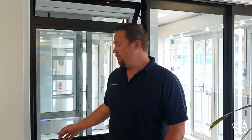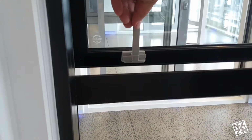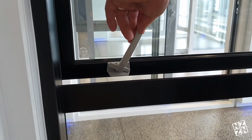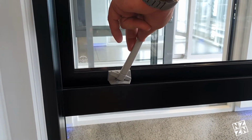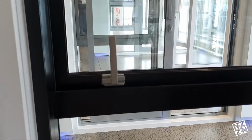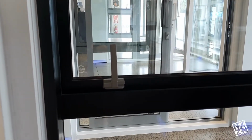So often we have customers report that we have broken wedges in here. The primary cause for that is when they're being opened and closed and this handle isn't in the perfectly vertical position, and it comes in and it hits the frame here. Something's got to give and the metal parts of the handle aren't going to break, so the plastic parts do.